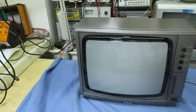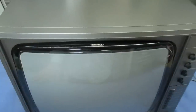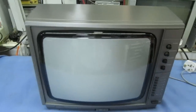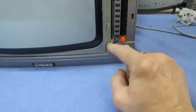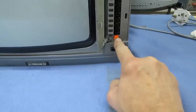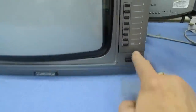It is of course the Thorn Ferguson TX90 chassis TV. This has still got the original sticker on there that says 'Made in the UK.' This is a particularly good example because not only has it got the tuning door, we've also got the little orange tuner which tunes in the stations and locks in. When you shut the door it operates the AFC switch — that's quite an important part of the TV and it's good that we've got that. Number eight's marked for VHS.